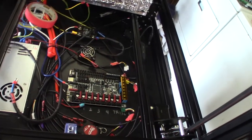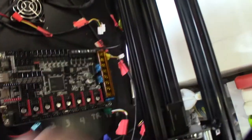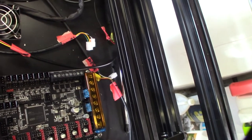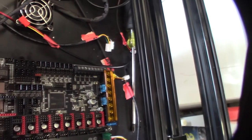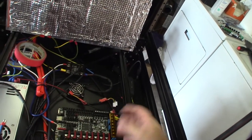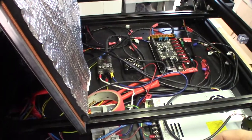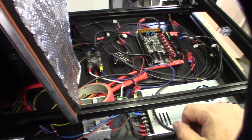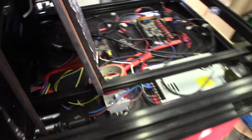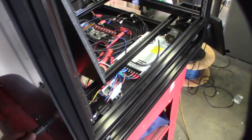I've got the board mounted. I'm going to use the original stock fan but might have to create some kind of duct system. The manual is in the box so I'll download the PDF. This has a solid state relay — it's an AC-controlled bed, so the hotbed output activates the solid state relay. I noticed the polarity was opposite from the power supply compared to the solid state relay — the brown was on the negative — so I need to check that. I'm going to fire this up without hooking any drivers up in case anything pops.